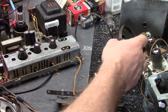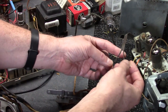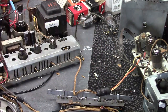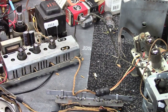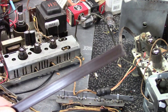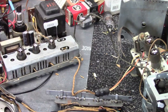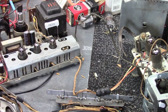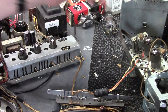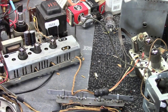One pain with the twin lead is that it just comes unseparated. If you want to split the leads apart and clean off the excess webbing between the two wires, get a paper hole punch of the right diameter and you can make a nice neat cutout. Otherwise you can use a sharp X-Acto knife or razor blade and trim it out.